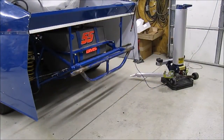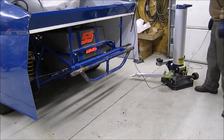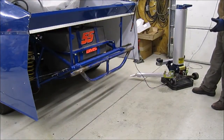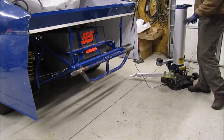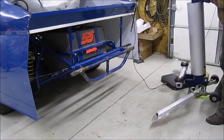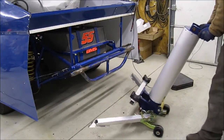Alright everybody, we've got the modified on the ground to test out the Burt air jack. I've also got it positioned on a scale pad — I figured that'd be useful information to see just how much it really weighs. According to our scales we're at 72 pounds. It is mostly aluminum; the base frame is steel, and I'm guessing the cylinder is also steel on the inside with aluminum on the outside. It might feel like a lot, but I can pretty easily pick it up to move it off the scale pad, and once it's on the ground and kicked up on the casters it rolls pretty easy, especially on our concrete floor.